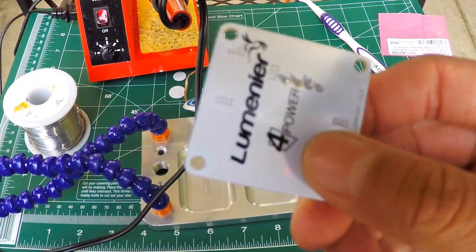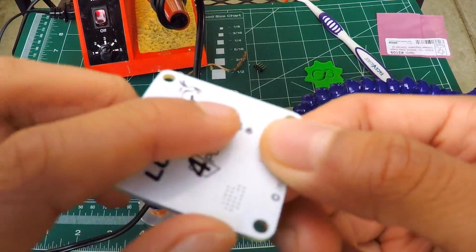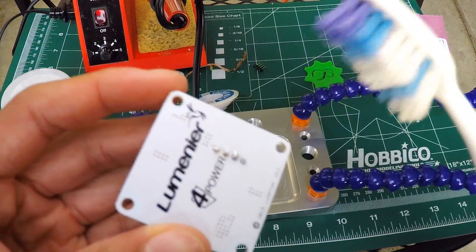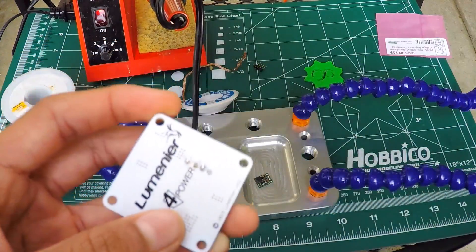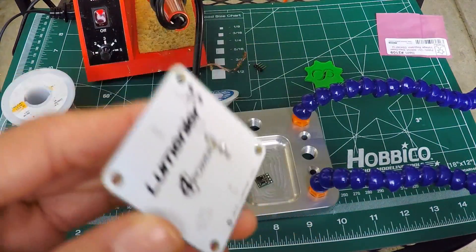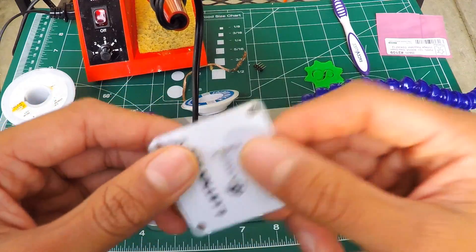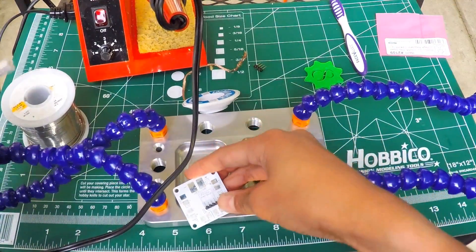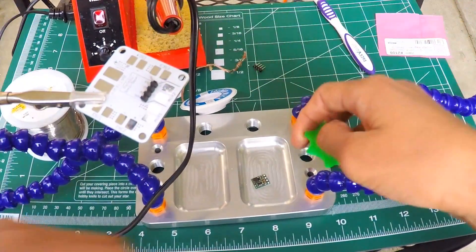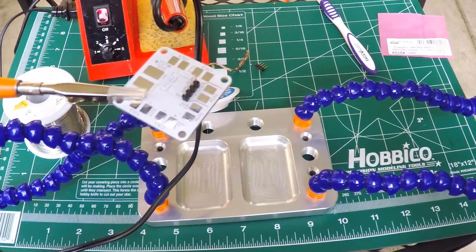One thing I just did differently: as you can see, it's much cleaner now. What I did was take a toothbrush, put some rubbing alcohol on it, and just scrub. The yellow stuff is called flux — it's an acid that attracts solder, which is good, but over time because it is acidic it will destroy your solder joints. That's why I took it off, and it does look cooler too.